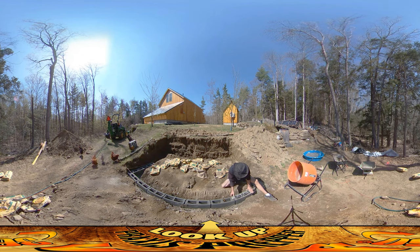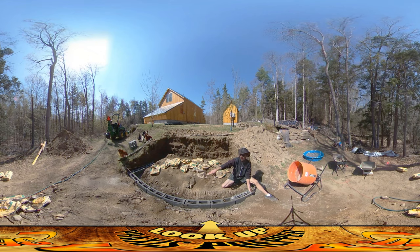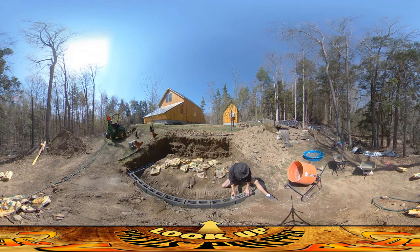I just try to make sure that it's going nice and flat all the way down and that it's roughly the same elevation as the brick next to it. I put an awful lot of extra concrete on here and it's a little thick, but I'm pushing it down in there. As I go I'm sure I'm accumulating errors from the other side over there because I'm just measuring off the brick next to it. But I can put an extra thick layer of mortar once I get this nice straight base together. Almost there — just kind of wedging it in there. Looks like it's pretty good.